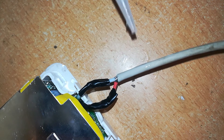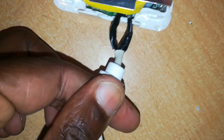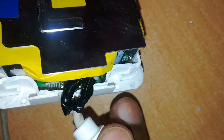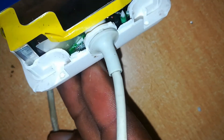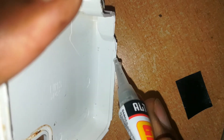Put some super glue all around the cable, then pull this junction over the super glue. Rotate the wire around like this so that the wires settle nicely in the charger, then place them inside. Next we'll place the upper casing on top of the charger. Apply glue to the inner parts of the charger — the inner edge. There's a portion where the glue fits in perfectly — apply it all around this edge and put it on top.